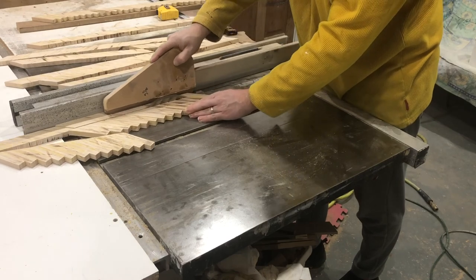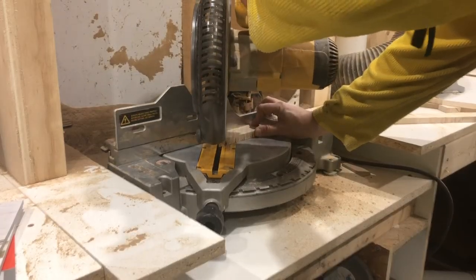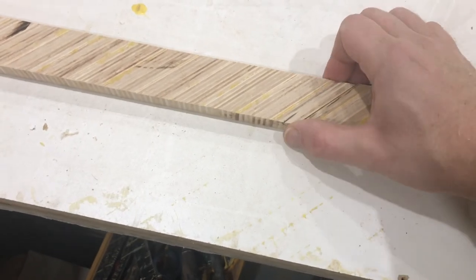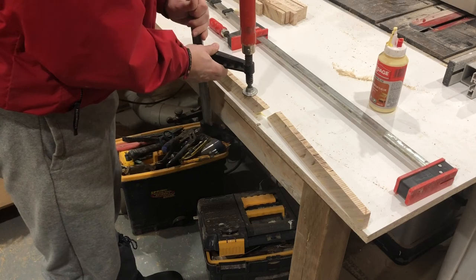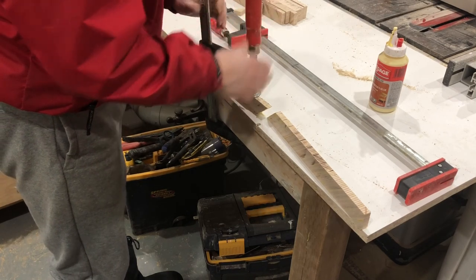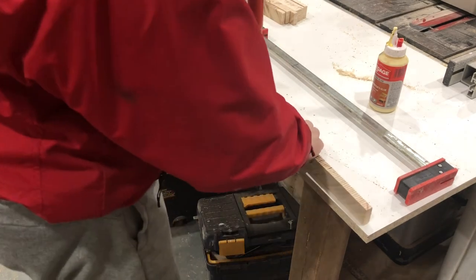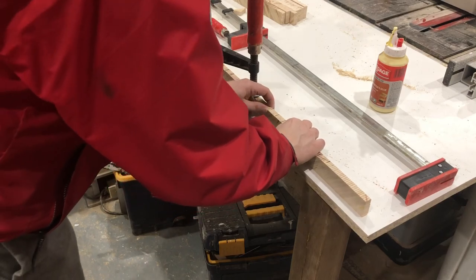There's actually two of them that broke. I'm going to show you how I fixed those — you could just put them together with a little bit of CA glue or PVA and glue them together. In my case, I cut them both on the miter saw at 45, then just clamped them down to the table and used a bar clamp to connect the two of them together, and left it overnight. Not a big deal.